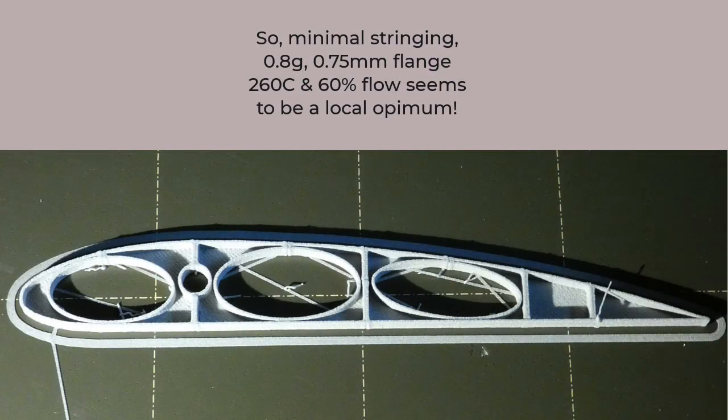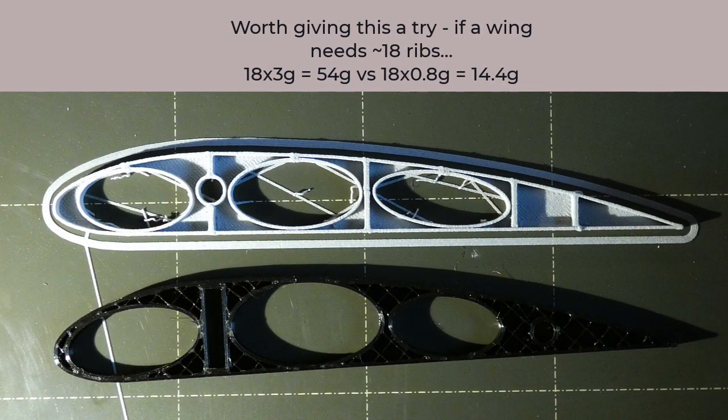At the end of the process, there are a few minor strings to tidy. The braces formed by the cuts seem to have merged with the spars and the flange. There are probably debates about the weight cost of forcing a thicker flange, but it seems to me that the additional stiffness is a useful trait for an RC wing rib.